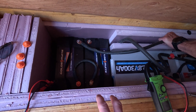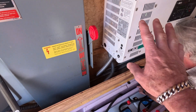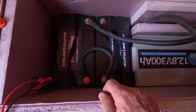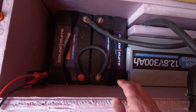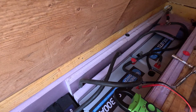So we went up there — we did this last year — and balanced them. We had an imbalance problem because the inverter up there let it run too long at too low a voltage. One battery is charged up higher than the other. This one's charged up about 12 volts, this one's about 8, so we're going to charge this one and balance them. Same thing with those two batteries down there.